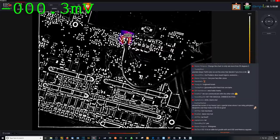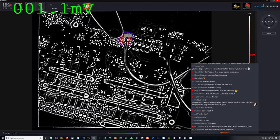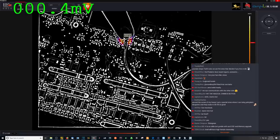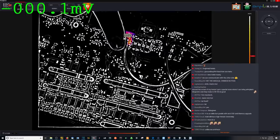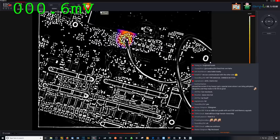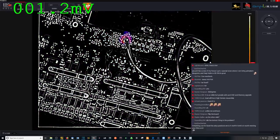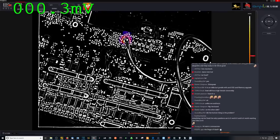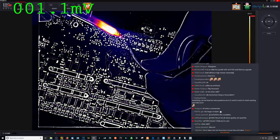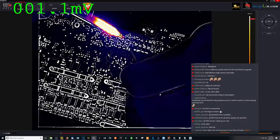This isn't really telling me much. The only thing that's warm is the spot where the cable's in. Yeah, that sucks. If you really want to start freaking out, resolder the cable somewhere else, maybe it literally is one of the components out of there. But I doubt it. Is any section here internally shorted? Do any of those pins have an internal short on it, like feedback or VBST or anything?